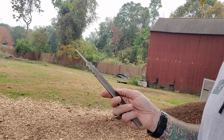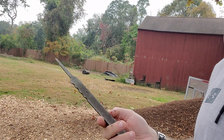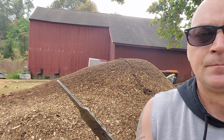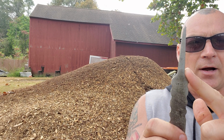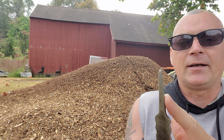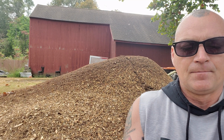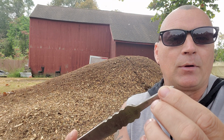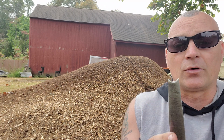These files make excellent throwing spikes. Literally what I did is, first thing I did is I got on a stone grinder and I ground down these areas here, right? Then I ground here on every edge. Then I went to the belt grinder. Oh no, then I did some spinning to create a tip. Then I created this on the stone grinder.